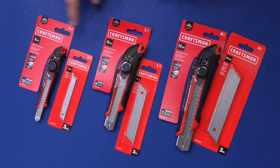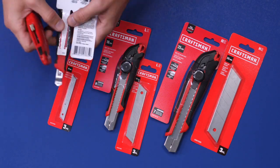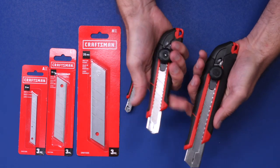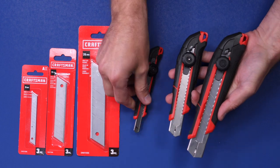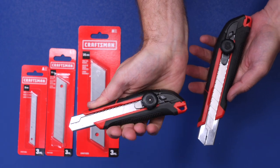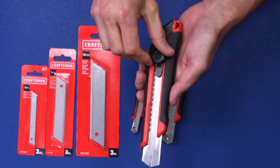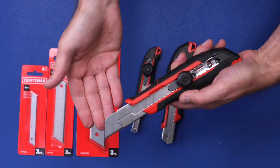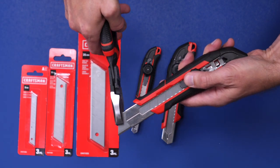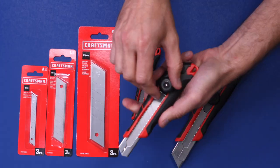Like I said before, these are the three different sizes of snap-off blade knives: 9, 18, and 25 millimeter. Here are the three sizes side by side so you can see how they look in hand. Now the way these work is you just turn the little wheel. When you want to snap off and replace the blade, leave it right around there, pick some pliers or stick it in something like wood, and you just snap it off like that. You toss that out and you've got a fresh blade. That's how all three of these work — they've all got the same wheel you rotate to get the blade out.